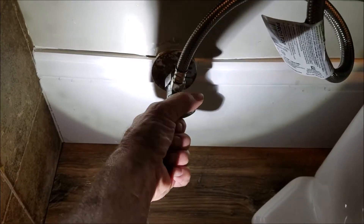I don't like this because the shutoff valve — you can see how much it torques on plastic, and it's really tight. We'll just flush it and let it drain, then get back with Home Depot for a replacement. We did install it, but that was straight out of the package — we're very careful with these items. This was cracked in the box. The first one they ordered was completely crushed two weeks back, so they ordered another one and it's cracked too — you can see the fracture all the way up to the handle. Outside of that, this installation is done.